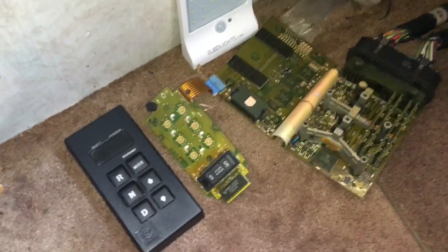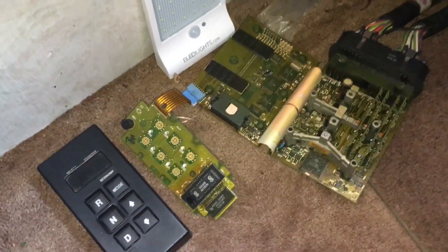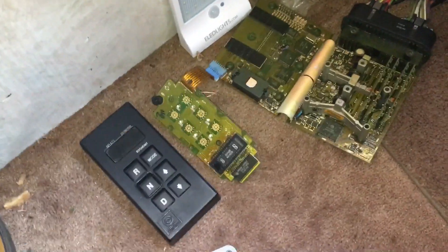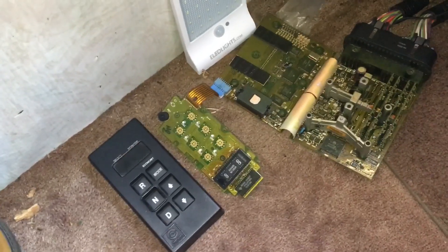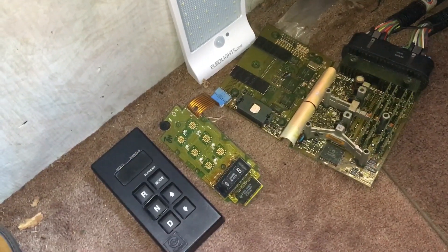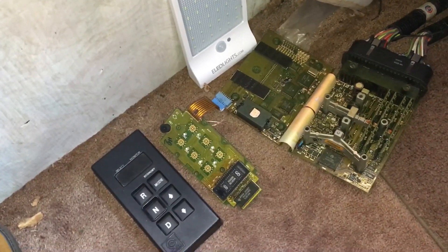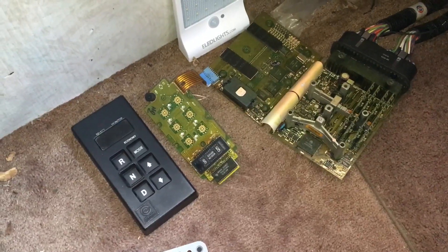That's what I did. I brought a hairdryer and heated up the computer, the push pad lit up, and I was able to start the engine. As long as I kept heat on it I was able to drive it. There's an inverter in here, so I plugged the hairdryer into the inverter and was able to drive it that way.